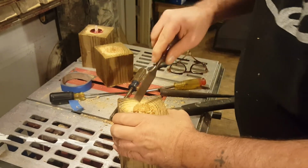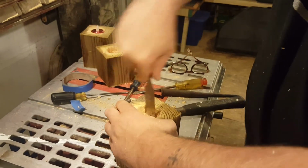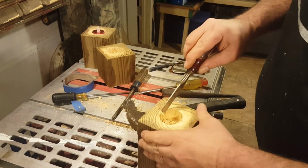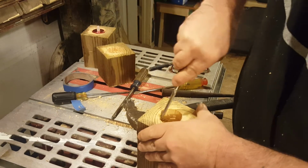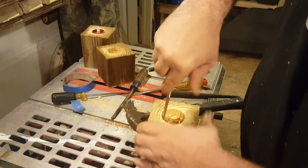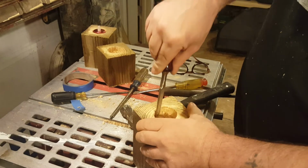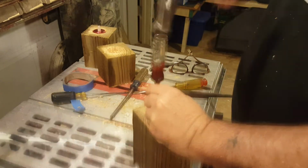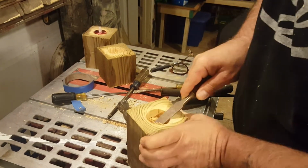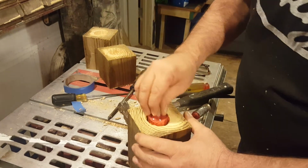Like I said, you initially want a paddle bit. A paddle bit is perfect because it creates a flat bottom. But I didn't have one quite big enough. So I made do with what I got. But I'm going to tell you, if you want to do these, I'm only going to do 3. I think Lumnah Acres, they did probably a dozen of them or more. I would want to invest in a bit. Absolutely, I'd want to invest in a bit.